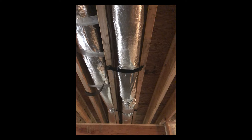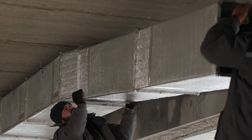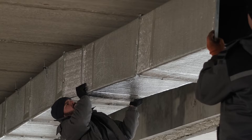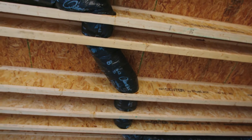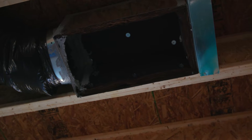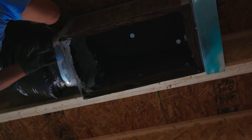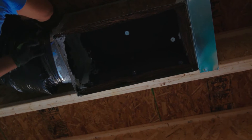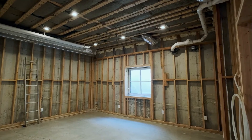After the floor openings are marked and cut open, ductwork is installed by creating rectangular ducts from sheet metal. In some cases, these ducts are prefabricated. Another option is to use flex ductwork that can be cut and joined to form longer runs. Regardless of which configuration you choose, all joints must be sealed properly. In fact, frequent issues in ductwork are related to the improper sealing of joints, which allows unintended elements to enter the distribution system and contaminate the home air.